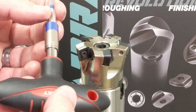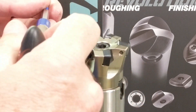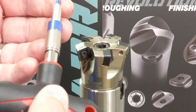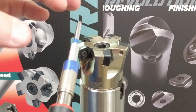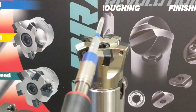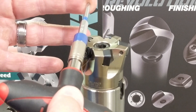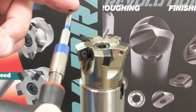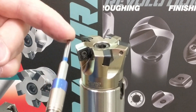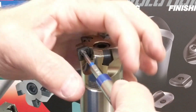In this particular case, I've got a T-handled torque wrench, which gives me good torque for removing the screws. It also ensures that all of my screws go in at the same torque — and from shift to shift or operator to operator, the same torque is being used. That's going to prolong the life of your driver bits and prolong the life of your screws.